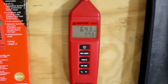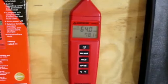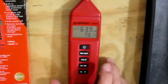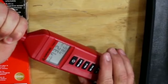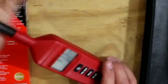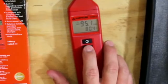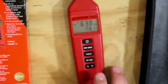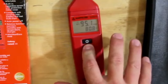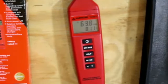If you want to get minimum and maximum temperatures, go into the min-max mode. We're in min-max mode now — we're at 78.1 degrees Fahrenheit. Covering the sensor causes relative humidity and dry bulb temperature to skyrocket. It went up to 80, with a max of 80.4 and a minimum of 78.1. In that mode it holds your measurements. Hold the button down for two seconds to leave that mode. So in min-max mode you can take return air, supply air, and dry bulb temperatures, store them, and do your calculations.